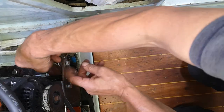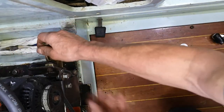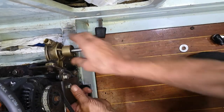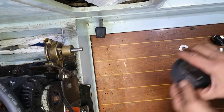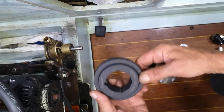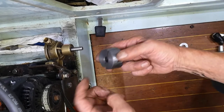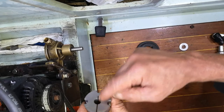Bear with me, I'm going to have to put this somewhere where you can get a view. There we go — that's the bolt through there and we can tighten this one up once it's in position. What we can do is put the belt on and then slide this back this way to tension the belt, then lock these nuts up and lock the hinge up as well — that's the plan, that's how it will work. For a pulley, what I've got is this — you buy whatever diameter pulley you want; they come in all different sizes.